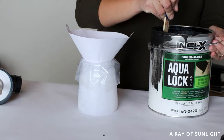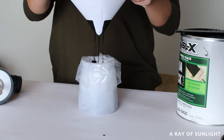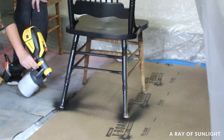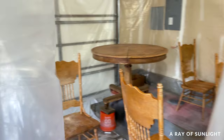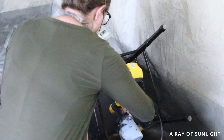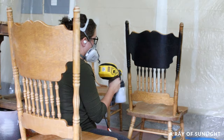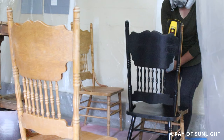We mixed the primer into our beginner-friendly paint sprayer, thinned it out with about 20% water, and sprayed it onto all the surfaces. Painting chairs can be tricky, but using a paint sprayer is way faster than using a brush or roller. I set up a little paint booth in my garage with plastic hanging from the walls and cardboard on the floors to keep paint from getting everywhere. The trick we found was to lay the chairs on their backs first, spray what we could, flip them over and spray again, then stand them up and spray the rest. You need to let paint dry between each of those steps, or make sure you can grab a place without wet paint when flipping the chairs.